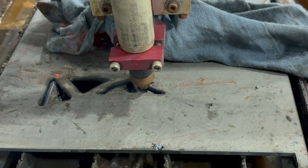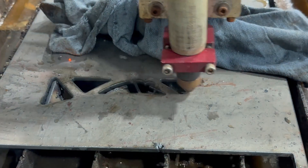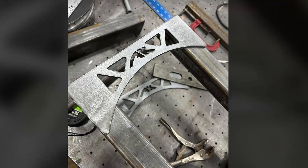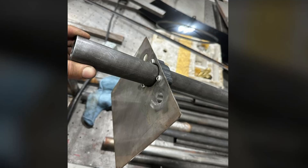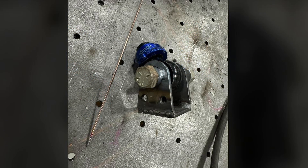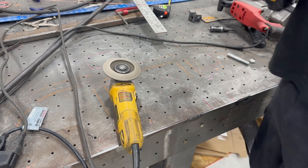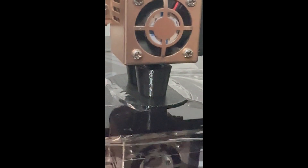Next up was plasma cutting. Plasma cutting can be extremely useful especially for projects like these. I needed to cut out the upper trusses that held the load cell, two mid plates that located the central ram used to push the shock and spring up and down, and also the shock mounts that were going to hold the shocks in place. Next I made some shock pins, which I had entirely too much fun building. I used my DeWalt lathe to taper the ends down, then 3D printed some knobs to screw onto the end of the bolts that I cut down.